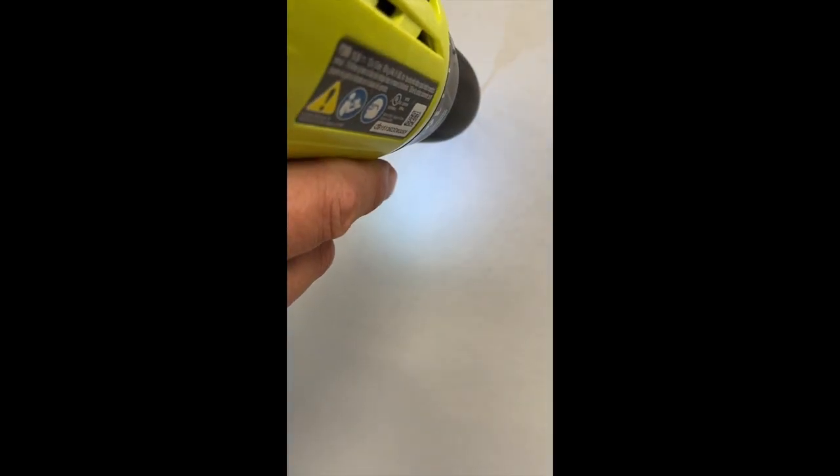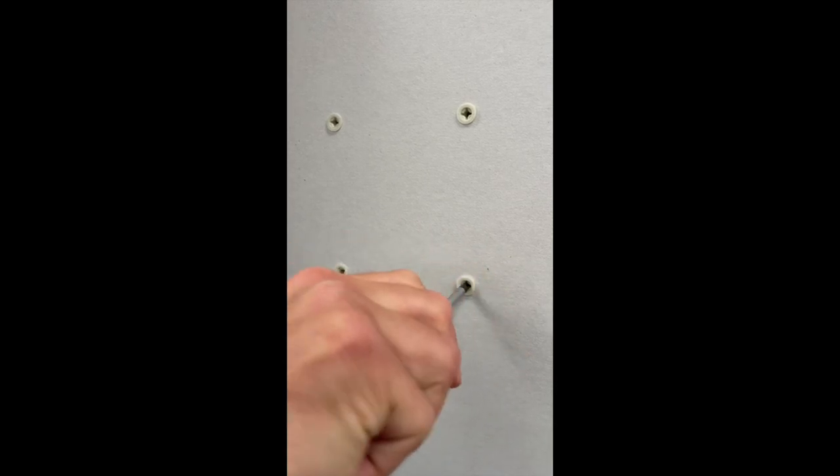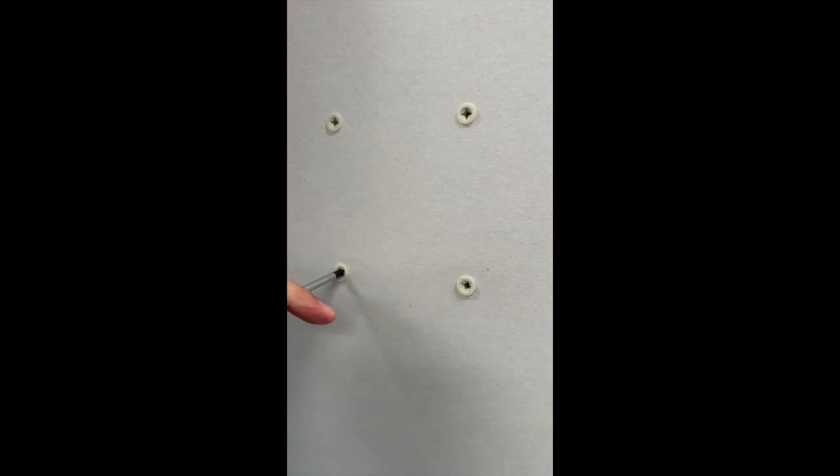With your drill and quarter inch drill bit, drill holes where you've made those pencil marks, as this is where we are going to be inserting our drywall screws. With the four provided drywall screws and a Phillips head screwdriver, push them in and turn clockwise to secure them into place. Please make sure that the drywall screws are flush against the wall, as if they are not it may look like the Brilliant control is protruding.